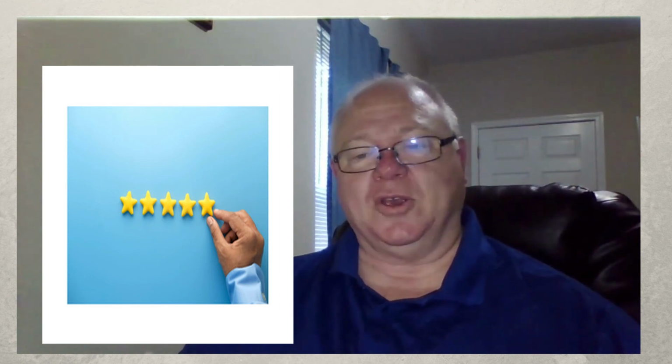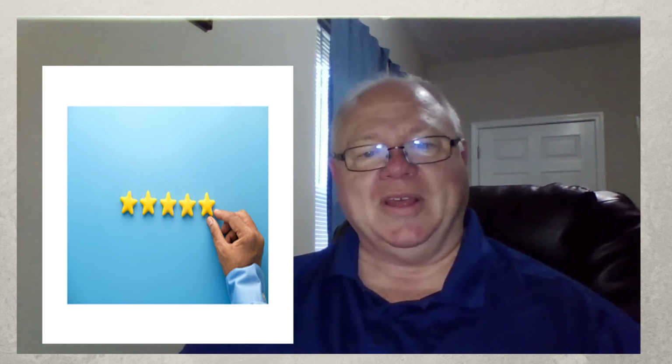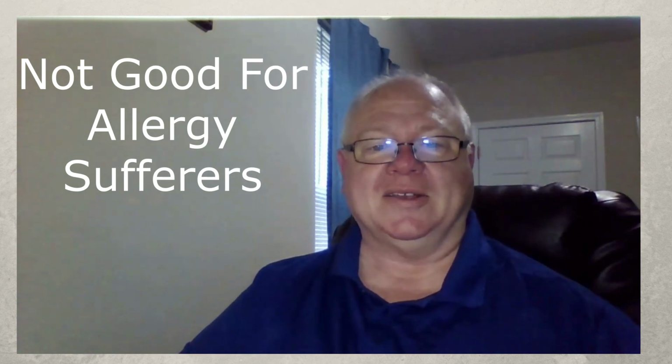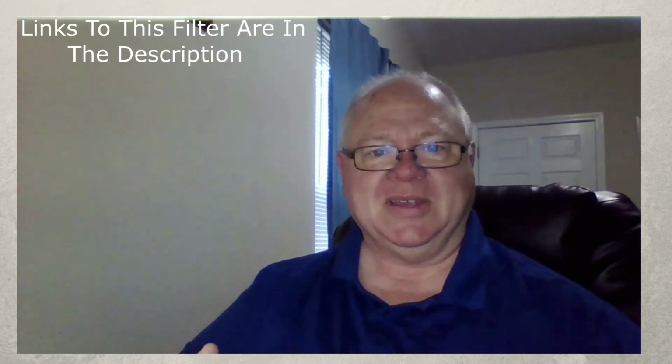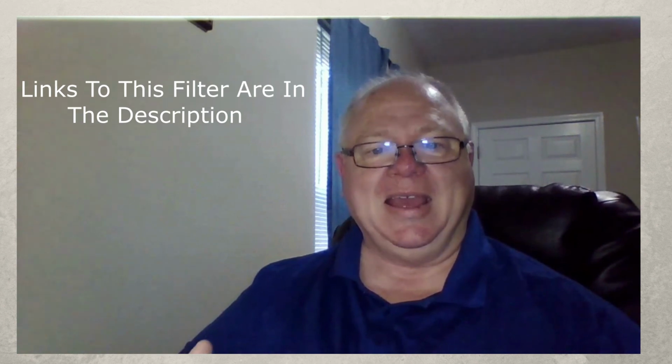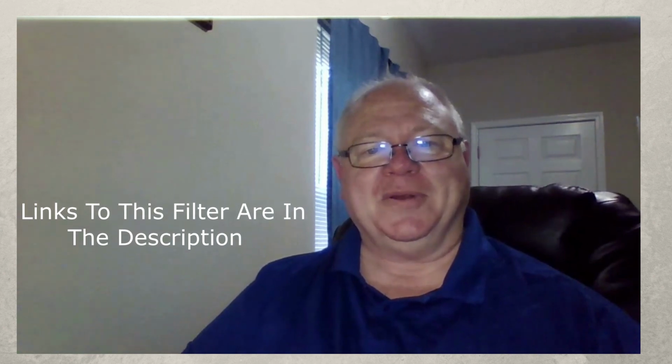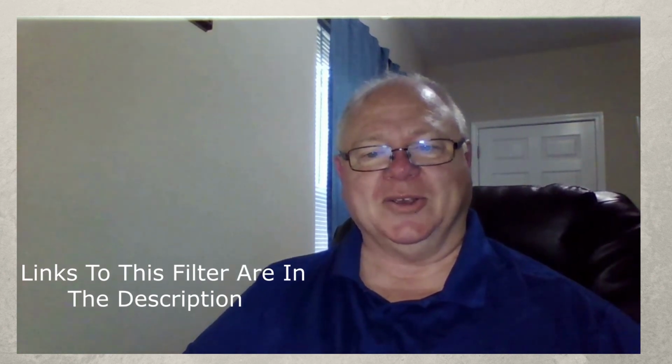So my conclusion on this filter is that the 3M Filtrete MERV 5 is a good filter, provided that you don't have allergies. If you have any kind of breathing difficulties, you don't want to use this filter. It's just not going to capture the kind of particles that you need it to capture. It's going to be great if you just need general household dust. This is the good one for you. Actually, it's probably the lowest cost of the pleated filters. It's going to give you everything you need, just not for allergies. So that's all I got on this filter. You can feel confident buying this filter. I think it's a good one.